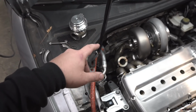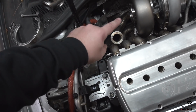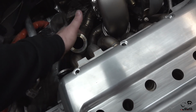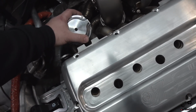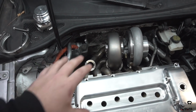And we're going to have to make a downpipe here and then something for the wastegate. We're going to have to figure out whether or not that downpipe is going to fit. I think we have enough room for 4-inch, especially with some 15-degree or maybe 45 or 90-degree pie cuts. I think we can make that happen. But if we can't, we will have to cut this off and relocate the gate. I don't want to, as having the gate there gives me the availability to remove and add springs whenever I want without having to get underneath the car. Again, the whole point of the VR6 swap, even in the B5, is to make things easier, cheaper, more affordable, more accessible. So the gate's going to be on top, and I'm hoping it stays that way as long as we can get everything to fit up.